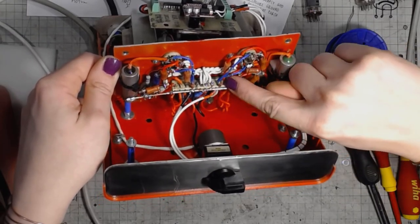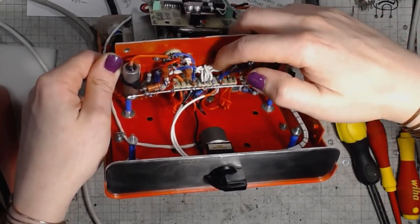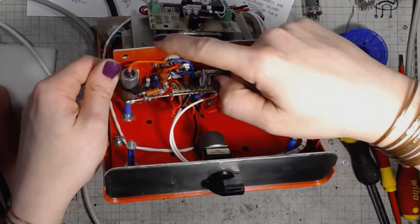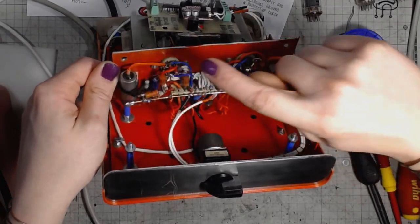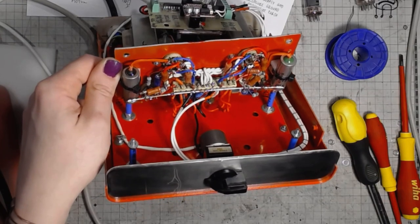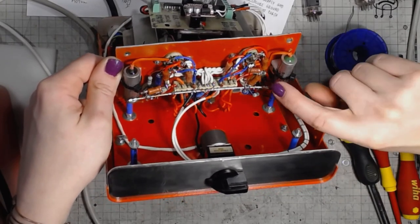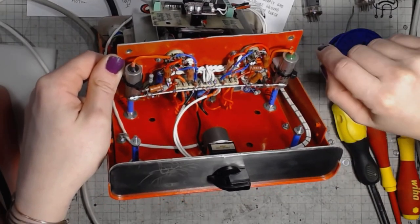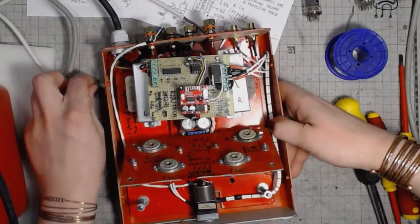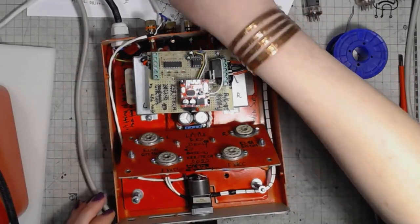So for the plates, there's a common resistor, 22 kilo ohms. And then the 0.1 microfarad capacitor, very old style. It's a paper in oil cap, made in Poland at Miflex. Yeah, this is the same Miflex that Skunky Designs likes to use, and I really appreciate her for that.